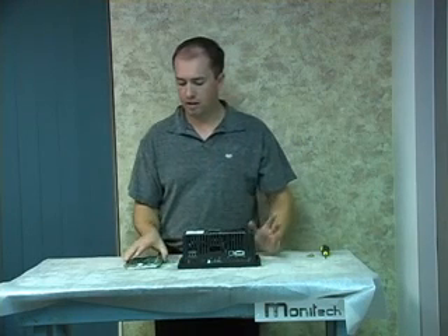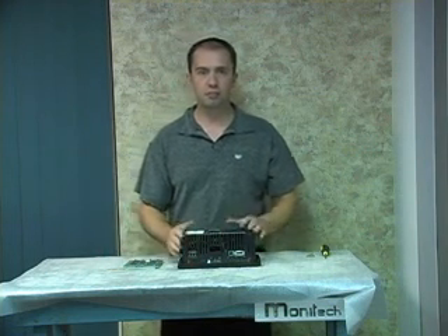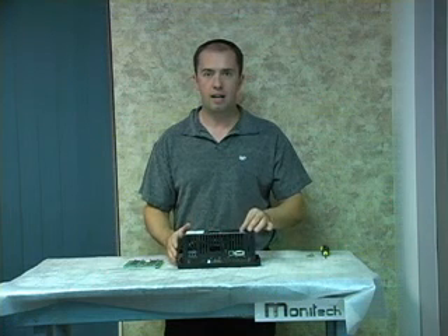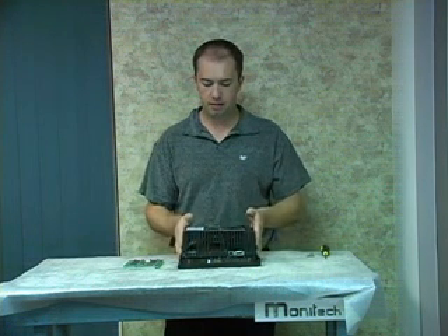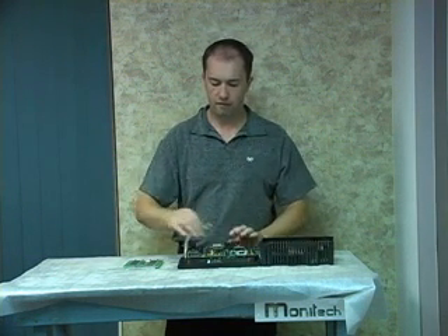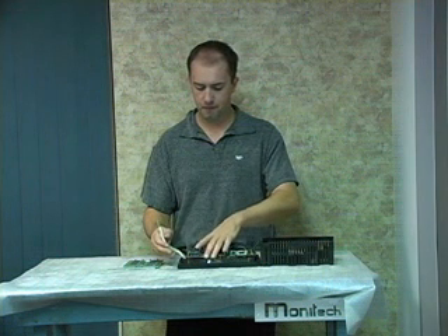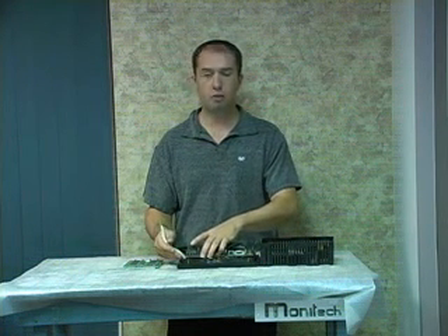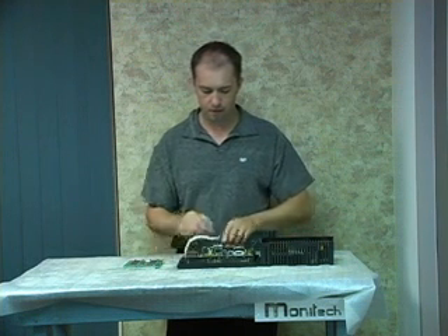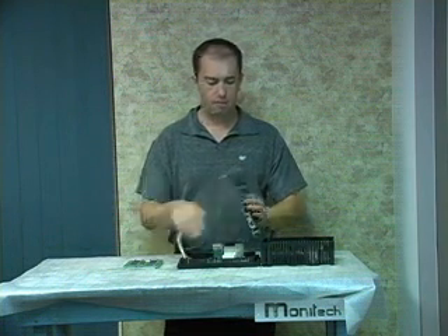On the installation of the new LCD from Monotech Industrial Display Solutions — very simple. I've pre-removed the screws to save you some time, and I've removed the cables. Basically, you remove the top, remove all the cables, and your old ancient fiber optic cable that they have for the lighting system — which the original equipment manufacturer will not replace for you — and you remove any keypad or touch screen, and pull the board back.